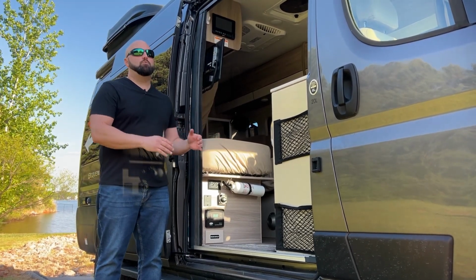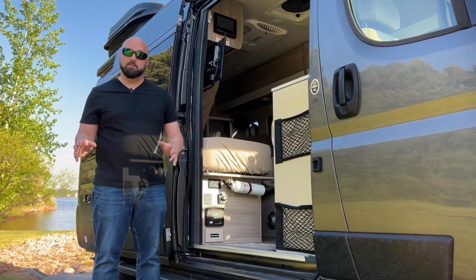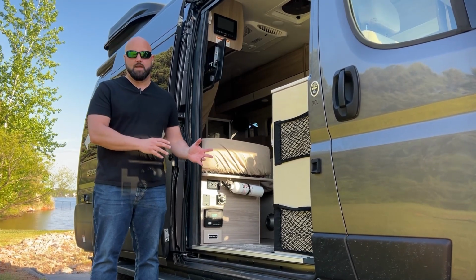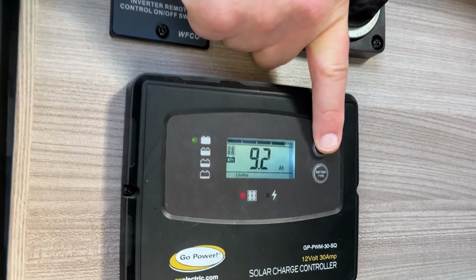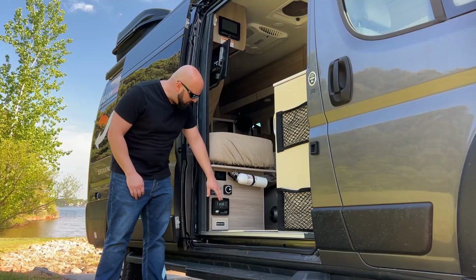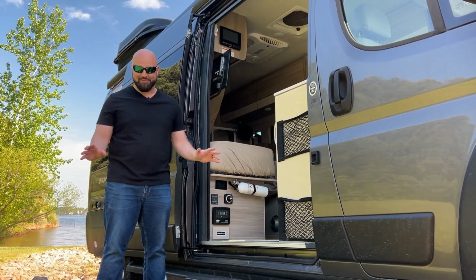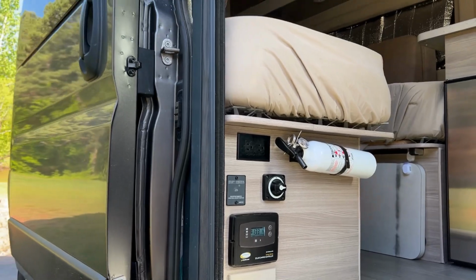This comes with an AGM, which is that second tier, and basically it's a plug-and-play system where you don't have to have maintenance. Flooded batteries do have to have maintenance and they have to be outside, so a lot of people are going away from that. You can also then, with this top button, scroll between voltage level, amps, and amp hours. It's very simple to use. It's plug and play, you don't have to touch anything, and you look at the screen and it just works. We love it, and it all came stock and standard in VINNY when we bought it.